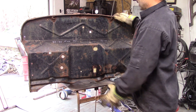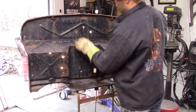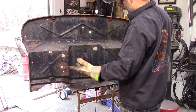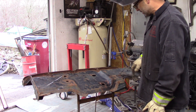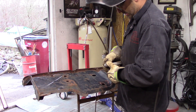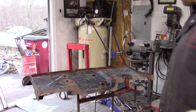I'm going to go up the firewall half an inch and use a little bit above the bend. It appears this is about two inches wider than the firewall area I need to fill, so I'll cut the edge off, cut the middle, bring it in so it overlaps, then cut it down the middle and re-weld it down the middle. I'm going to remove everything I don't need and make some rough measurements.